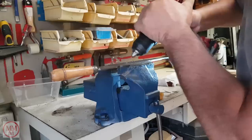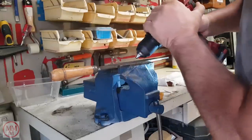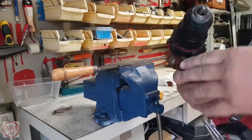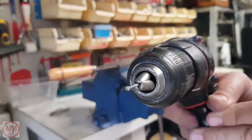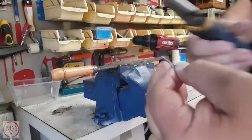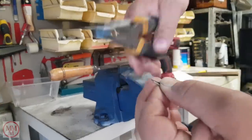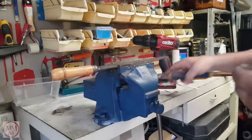I've done this many times in the past, and the end product can look very, very similar to an original Matchbox axle. Always remember to finish them off with some fine emery paper and make them shine like new. Here I am cutting my new axle slightly longer than the original. This way I have some metal on the end to reform to captivate the wheels.